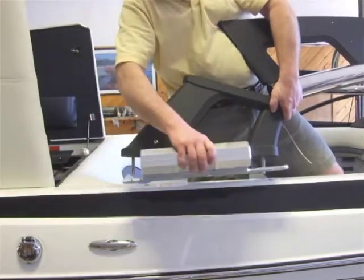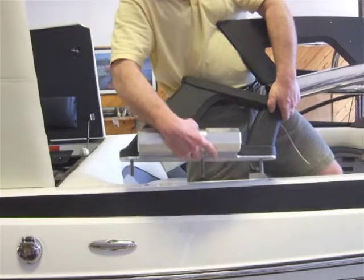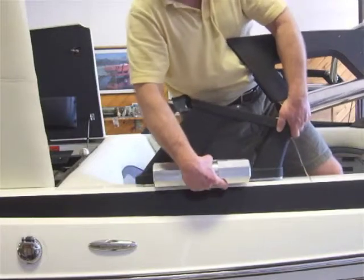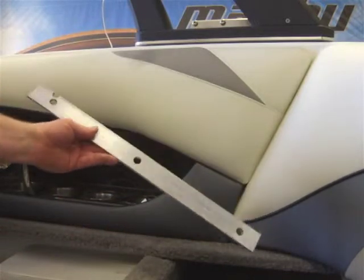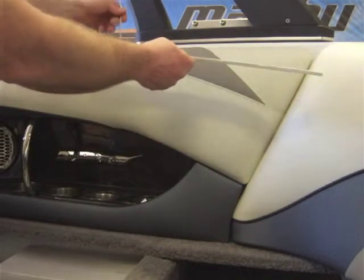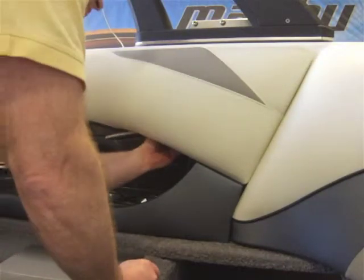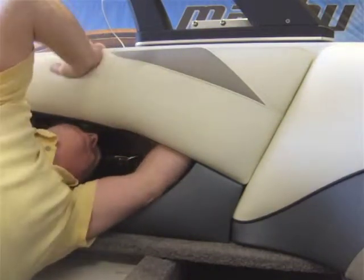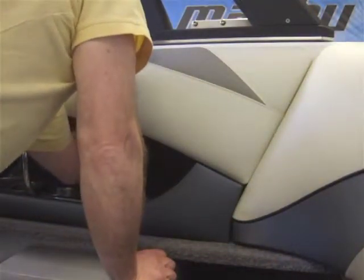Find a spot where it will balance, insert the base plate onto the studs, and then lower it carefully back into the pre-drilled holes in the boat. Once in, make sure to align your backing plate so your anchor light wire will come down through the pre-cut notch. If you install the backing plate backwards or upside down, you will not get your anchor light wire back through the proper hole. With the backing plate on, go ahead and reinstall the nuts to hold the tower base down to the boat.